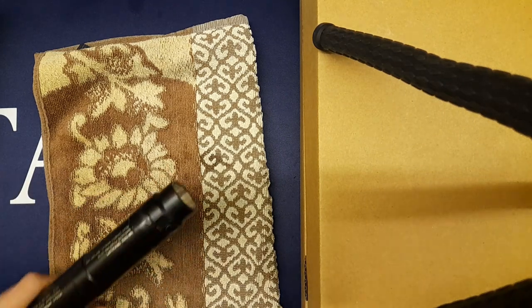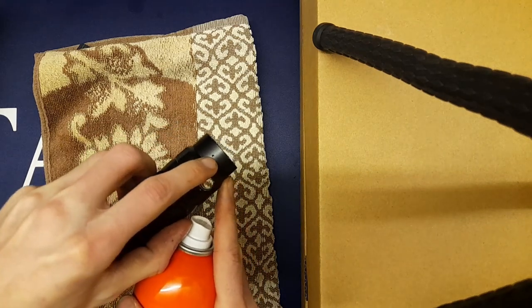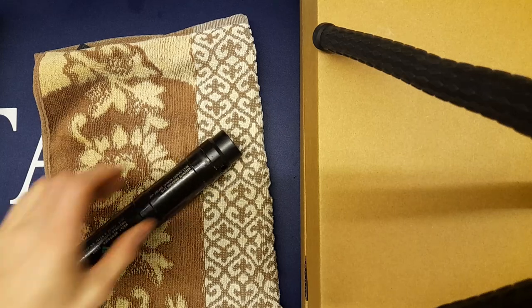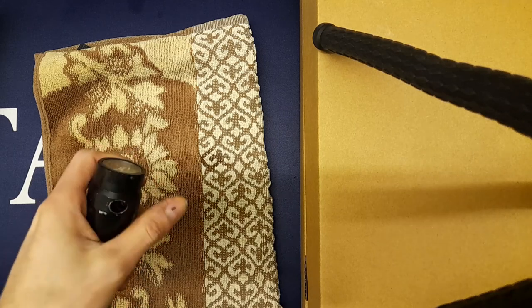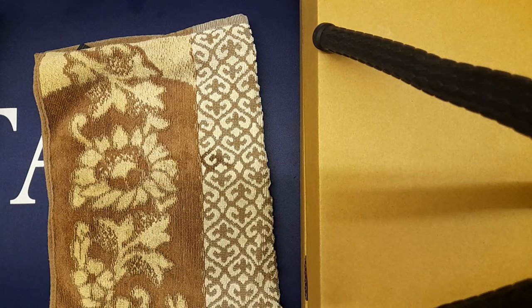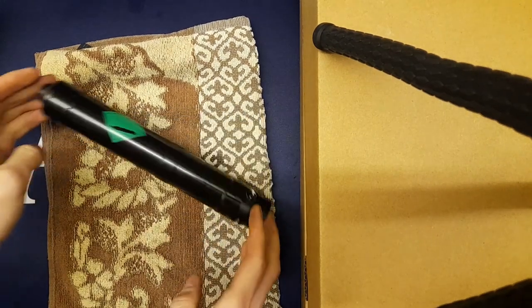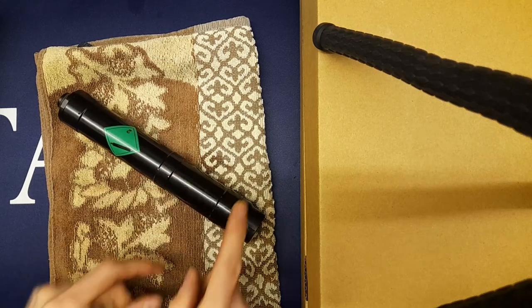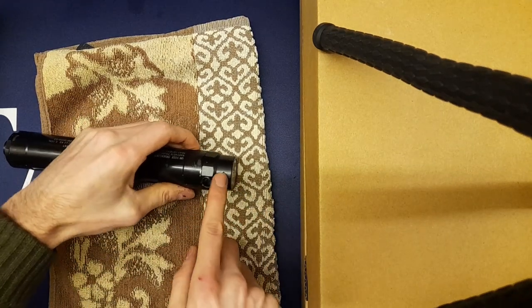So we know we're going to have to change that one on the back. While we're at it, we'll check around the outside — that bit's actually fine — and check the other side too. We're also going to check the breather hole for the pressure gauge, which is just here. This is one we're starting to see more and more leaks from as the guns get older. We put a tiny bit of leak detector on there and it's leaking out of there too — a little bubble came straight out.